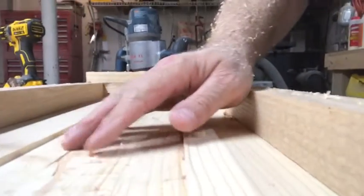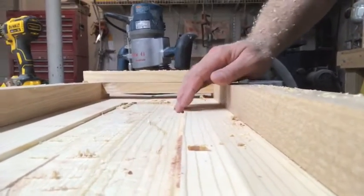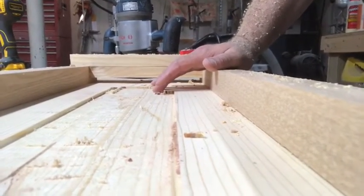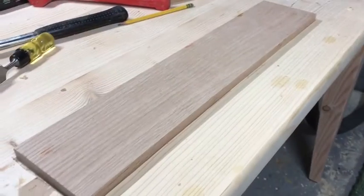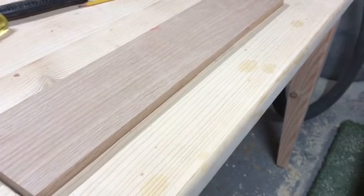As you can see, I've routed out a pocket in here, and I'll cut a piece of wood that will glue into that. I've gotten rid of all that split pine that was weak in here, and what that allows me to do is have a much more solid base. That is essentially what a Dutchman looks like, and you can see it stands very proud.